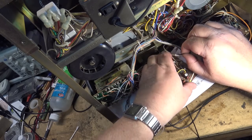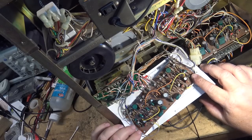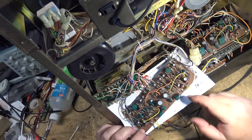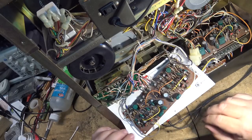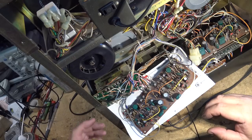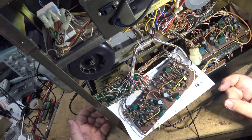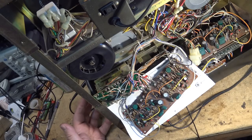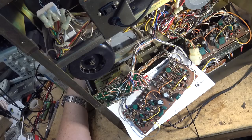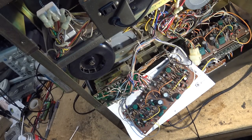And then I'm just gonna turn on the power and listen to that noise and bring my soldering iron close to some of these transistors and see whether the noise gets louder or softer, because it could be thermal either way. When you heat it up, generally you'll cause the plastic to expand. Typically what causes this noise is the junction on the silicon failing, where it's connected to the outside world. So typically, by means of heating and cooling, you can determine which component is bad. And you've seen me do that before. I did that on a preamp that was noisy a while back.